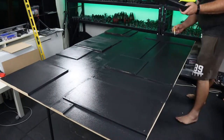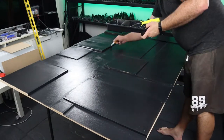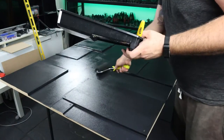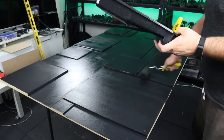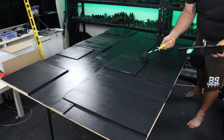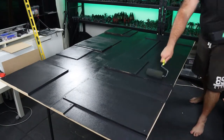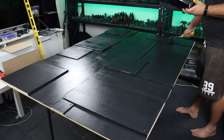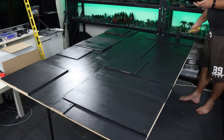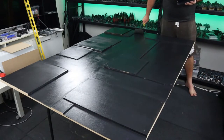After the next stage it'll really start to pop. I always like to give a table a second coat just in case — I don't want to miss anything. As you can see around the edges of those boards, the MDF does soak it up a bit. So it's good to go around once or twice to make sure it gets sealed completely, otherwise the moisture will get in there and you'll start getting a puffy table in about a year or so.